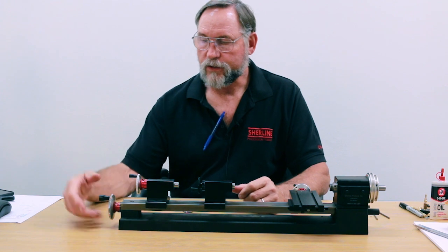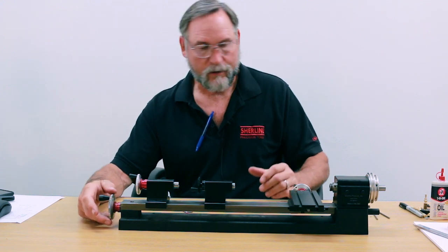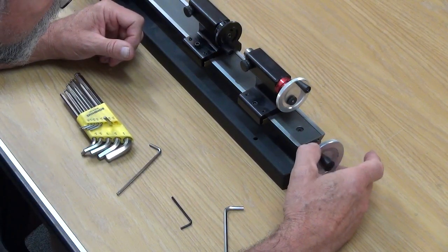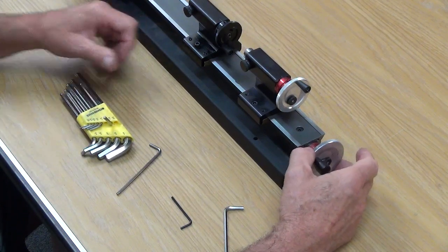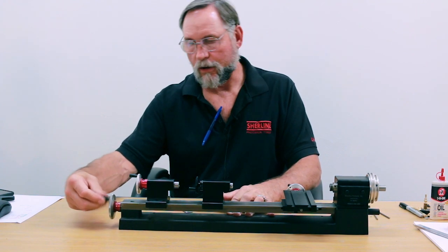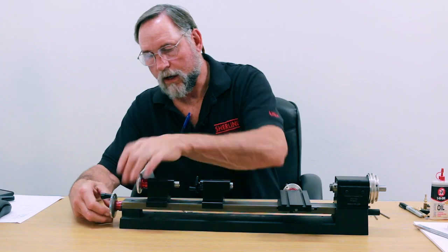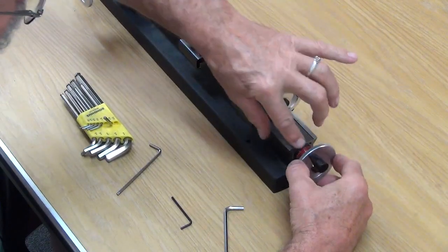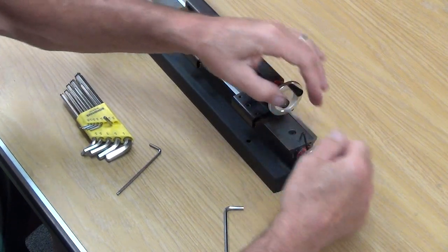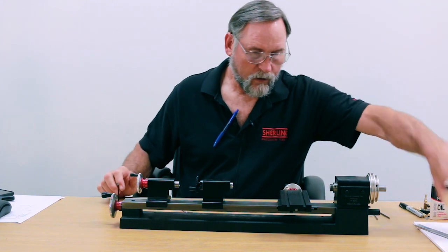The alternate way to remove your tailstock is to remove the hand wheel on your Z-axis and then slide it off — you can do this, but why? If you do, on the Z-axis I actually have four thousandths worth of backlash right now, so you're going to want to get rid of that backlash when you put the hand wheel back on. The collar is unlocked; I'm going to turn it so it lines up with the set screw hole for my hand wheel, get it in my set screw, and put it up about there.